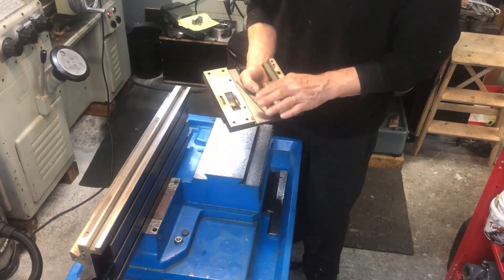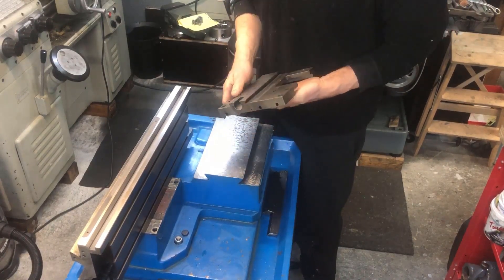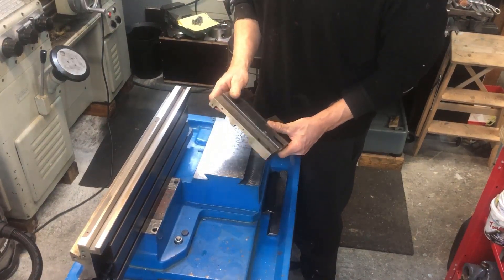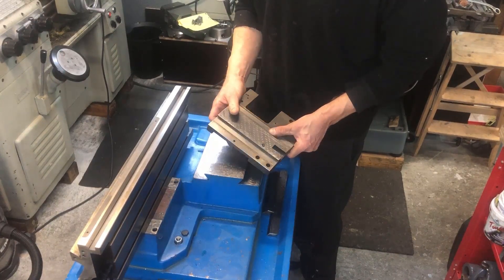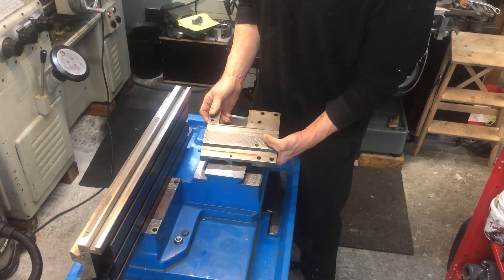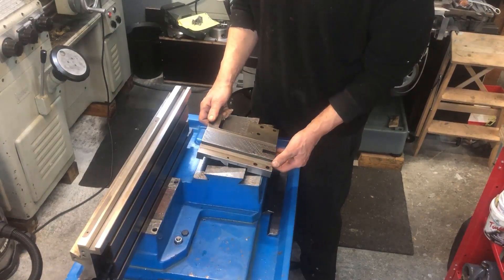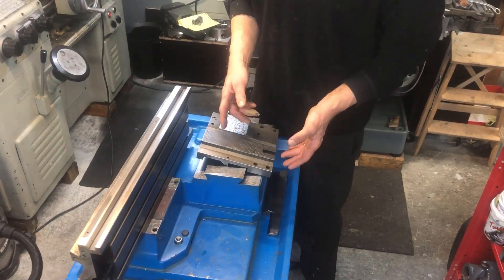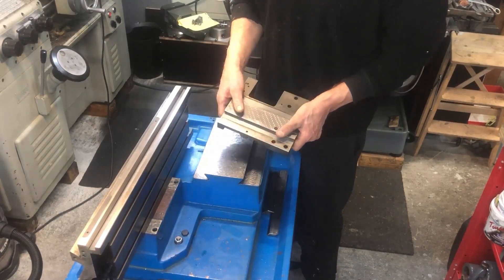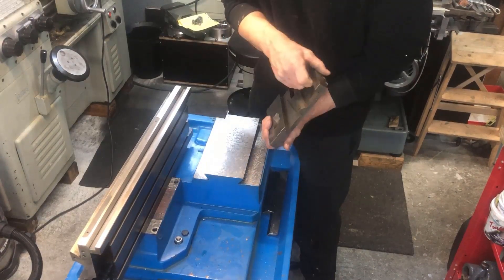But if I should flake this, it would be with a hand flaker or hand scraper. I have flaked here just for show, so it is easy to see how flaking with the BIAX looks like — rather intriguing and an eye-wash effect, so I can understand why people want to flake. But at least to my understanding, as I have been taught: flake the unexposed ways, not the exposed ways, because then you invite grit in a more aggressive way.